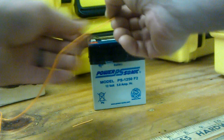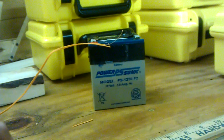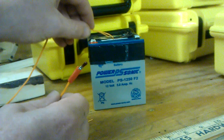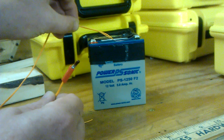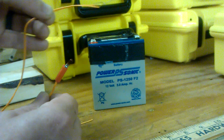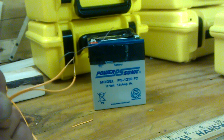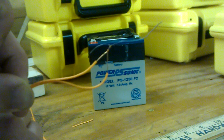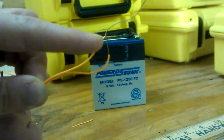Now, here's just a battery — put one in the positive terminal here. Here's the tip of the e-match; I'll even expose it a little bit for you. And here is the side over here on the negative terminal. Watch what happens to the wire, not so much the e-match head. Now I don't know if you saw that, but the wire glowed red hot. Notice the match didn't go off. Electricity follows the path of least resistance — the circuit from both the positive and negative terminal of the battery followed the path of least resistance and burned up the wires.